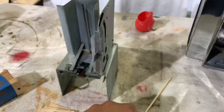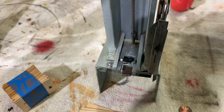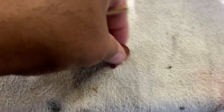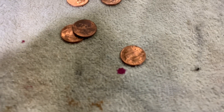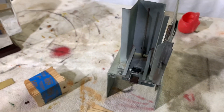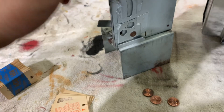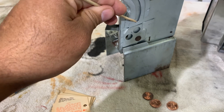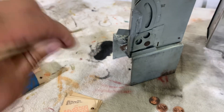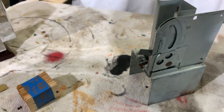That's not the only problem with these machines. As you can see how they made them, they are very sharp-cornered here. If you look at the modern penny, you can see how tight that edge is — that little edge is sometimes nothing but a pain. It locks up inside and gets lodged in the corner somewhere. It happens all the time. If it does, you need to take your machine, take it out, take a toothpick and just kind of slide it out and start over again.